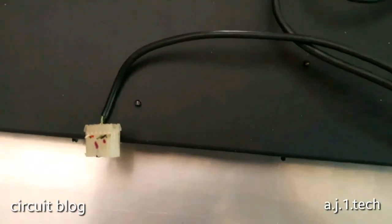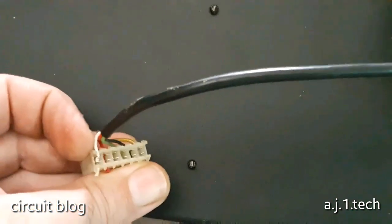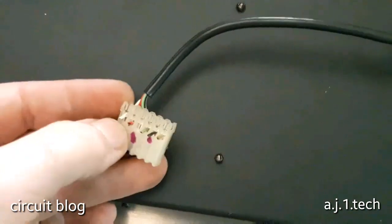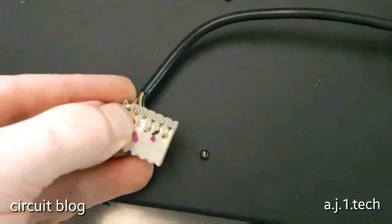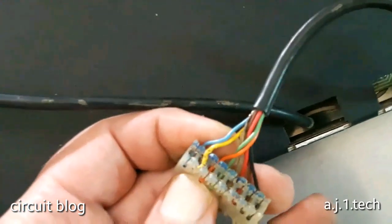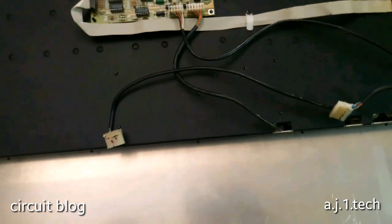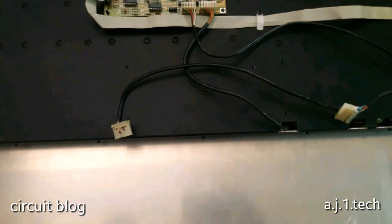If I zoom in at the jacks, I believe I might find the problem. There is a loose connector over here, or a loose wire from the jack from the header, as you can see. This is here, and the other one is right, the yellow one, as you can see. So he must have yanked them when he was cleaning up the unit. But there is no harm in inspecting all of the components before we power it up.